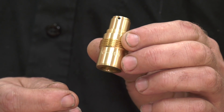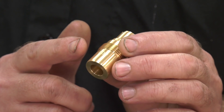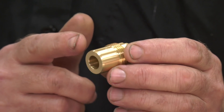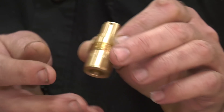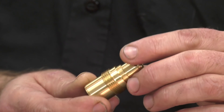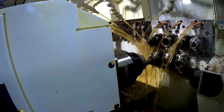What about this one here? This job has the B-axis on it to do the holes in the end, plus we do engraving on it, which is really quick and dead easy to program. Before, it was just a bit of a faff doing the program. But with the Citizen software they provide, it is really quick — you just tell it what size writing you want, tell it where you want it, and it just does it.